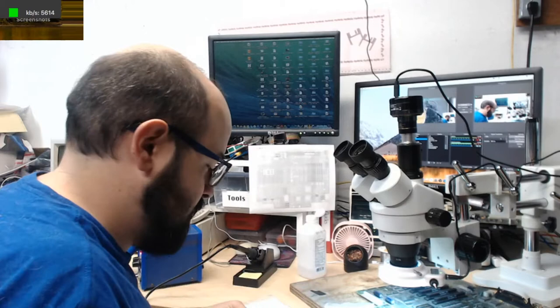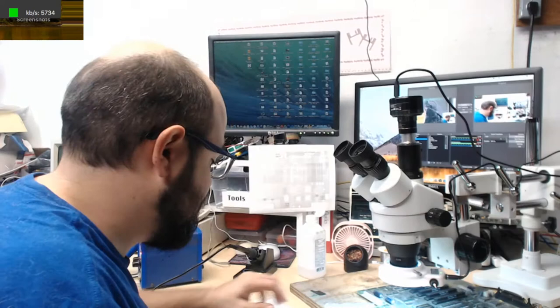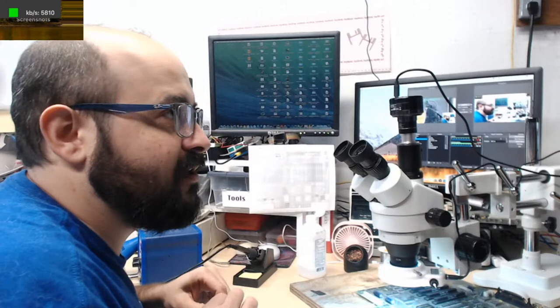The one I got actually came with a hard drive. Unfortunately, the hard drive tried to spin up. I tried to open it up to fix it, and in my haste, I reversed the ROM chip on the hard drive circuit board, and I think I toasted the circuit board.